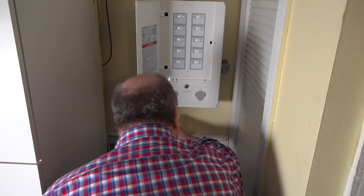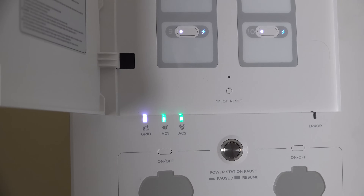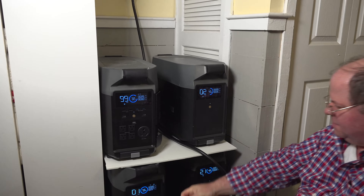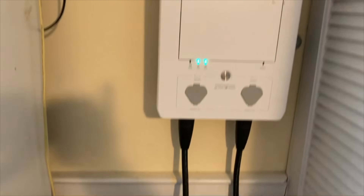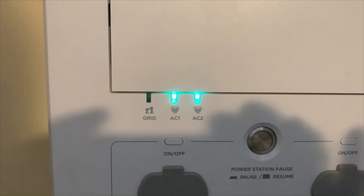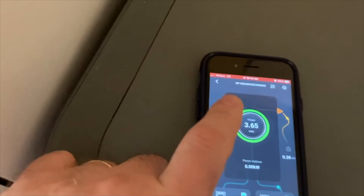With the Delta Pros connected to the smart home panel, this thing is ready to go. You'll notice there are a couple of LEDs on the front — one for each Delta Pro connection and one indicating street power is on. The first test I wanted to try was switching the main breaker off to simulate losing power to the house. This is where a setup like this is even better than a gas generator: because it's fully electronic, the changeover was instant. He's got his home office on this circuit and none of the computers even blinked when the power went out. Even with a top-of-the-line Generac, you're going to lose power for about one to two minutes during a traditional gas generator switchover.